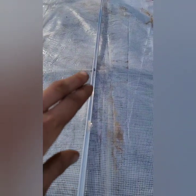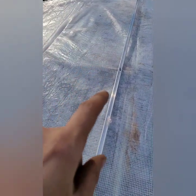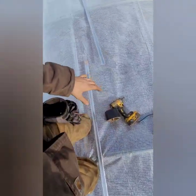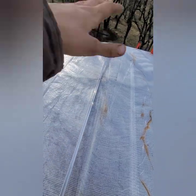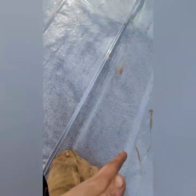I really like this method — this is how I retrofit existing greenhouses. Say this is just a greenhouse frame — yes, you can put panel like this before you put your plastic. I wanted to do it this way for two reasons. One, I like it because now they only need one inflation blower for this whole entire greenhouse because the air can pass through right here. Versus if this channel was underneath on the frame and I pulled all this plastic, I would have to buy two inflation blowers. It's not going to leak because a big black roll of plastic gets pulled over this and wiggle wired over this section, sitting about 12 inches on both sides.